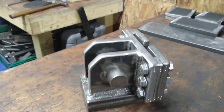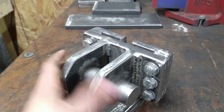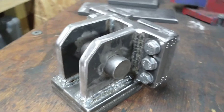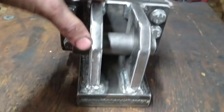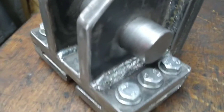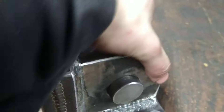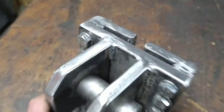The runner's made up and it's all fully welded now. The pin's still free-floating in there, so that's pretty good. The multi-pass is all over. In the bottom it's restricted how far you can get the torch, but I've done multi-passes top and bottom on these. With a 180 amp welder that should be pretty sufficient — did a good grind on either side.